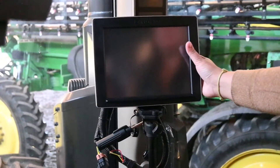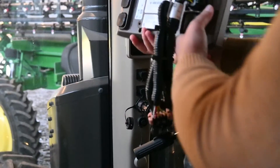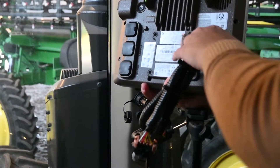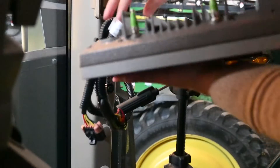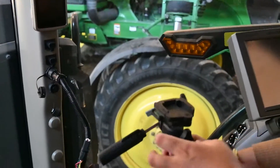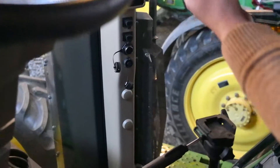None of the displays have completely powered down for our video — we just have it sitting here. But you may have it on a display mount where you have an ethernet cord plugged in, a video cable plugged in, and the wiring harness. Once the machine is completely powered down, you will want to unhook the wiring harness from the display, and then remove all your bolts and nuts to get it down from the bracket mount. Once the display is properly removed, we highly recommend also unplugging the wiring harness and moving it inside so that it doesn't corrode.